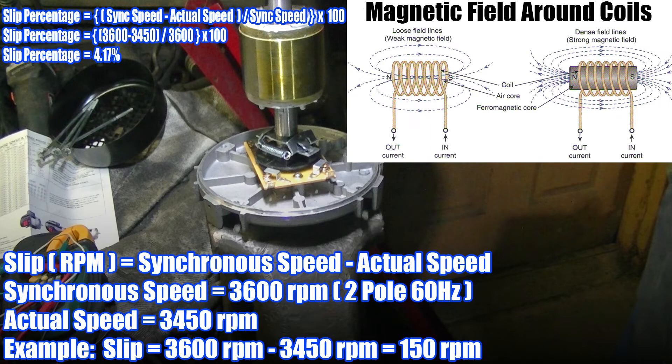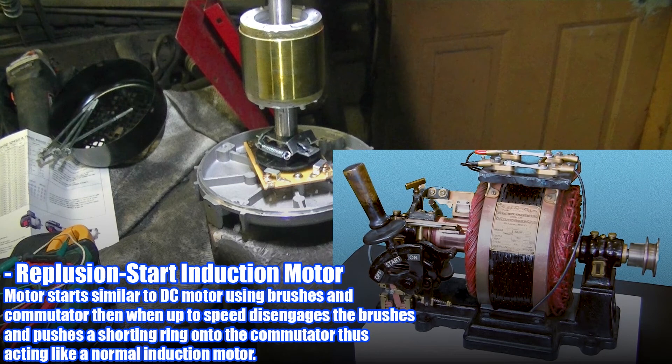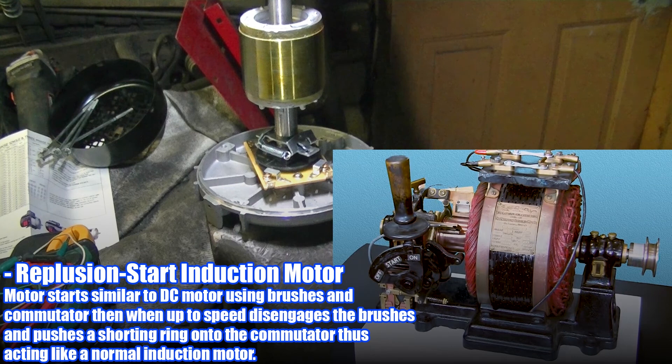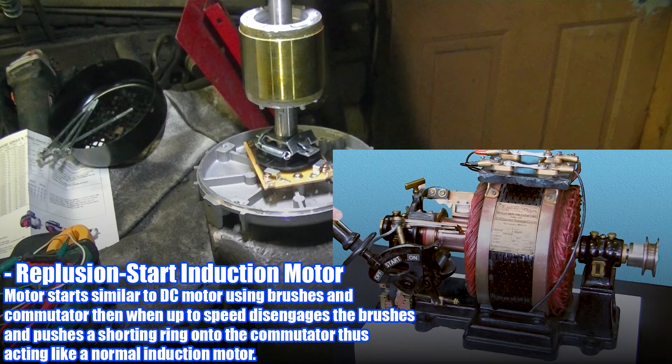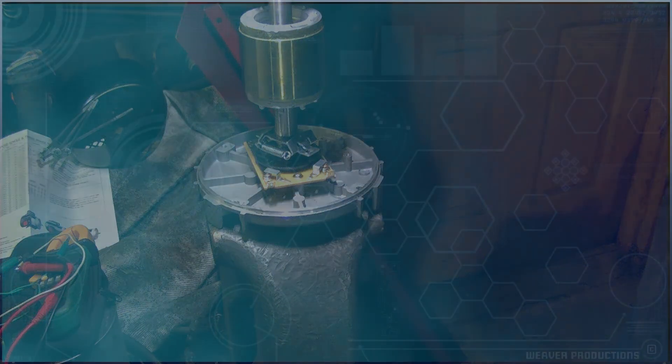This is the answer to what they used to call the repulsion induction motor, which is kind of like a DC motor with brushes and a commutator. This induction motor is the solution to that, because it doesn't use brushes — it uses induction to run itself. No commutator and no brushes to wear out, so it's a much better solution. Basically, you're using induction like in a transformer: the field cuts across the conductors on the rotor, creates an opposite and equal magnetic field, and that chases the run winding around and around — that's creating your movement. Hopefully that makes sense and I didn't overcomplicate it.